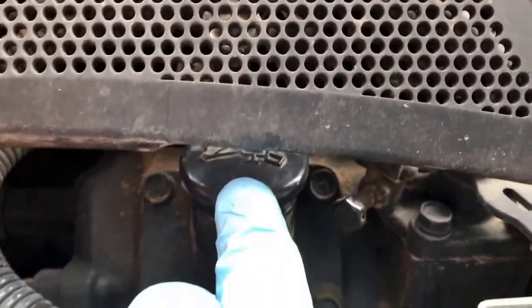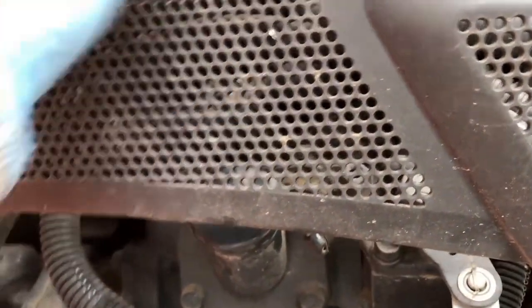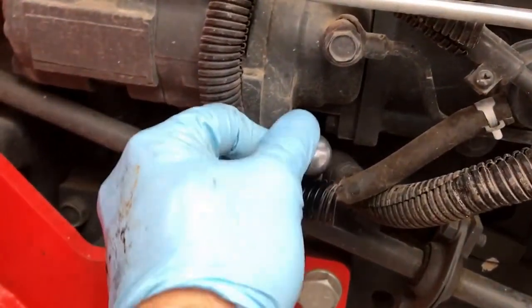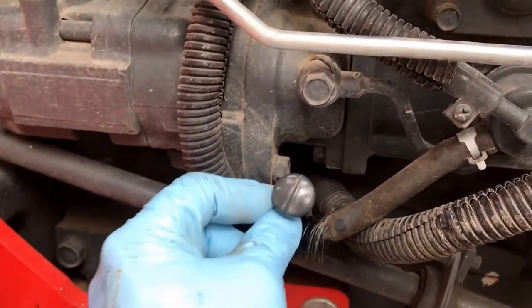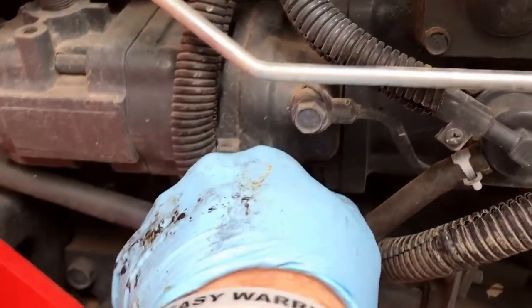This was a little frustrating to me — the oil fill is right here. I think I can snake a funnel in from the top if I've got a real skinny neck funnel. And then the oil dipstick is right here. It's not really labeled at all — nothing about it says 'oil dipstick.' I couldn't find it for the longest time because I was looking for something I could hook my finger in, and it wasn't there. I finally found it; it's just a little short dipstick.